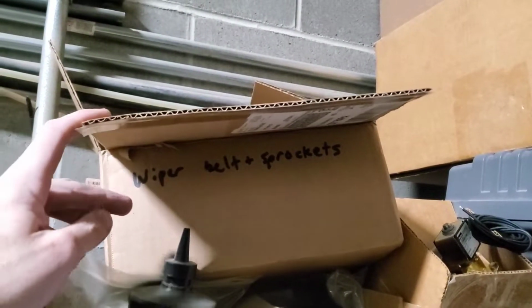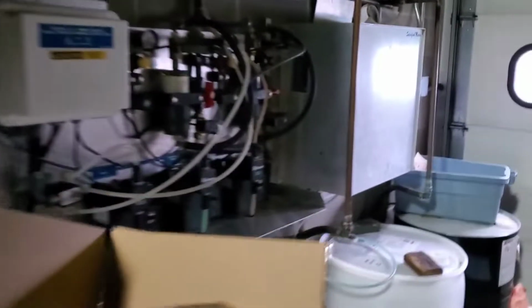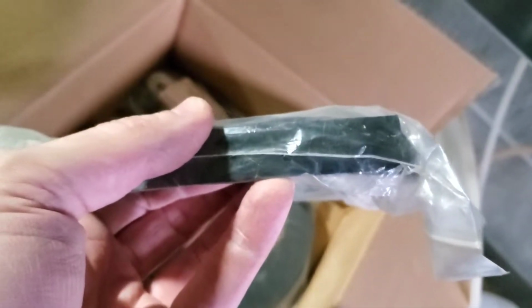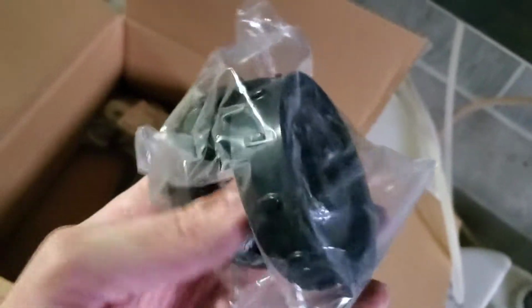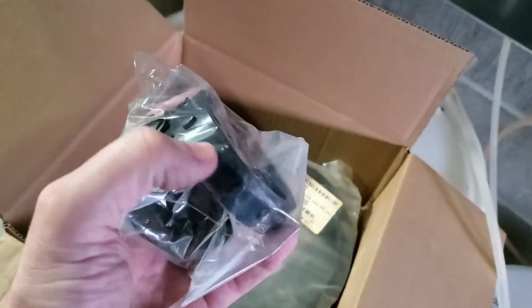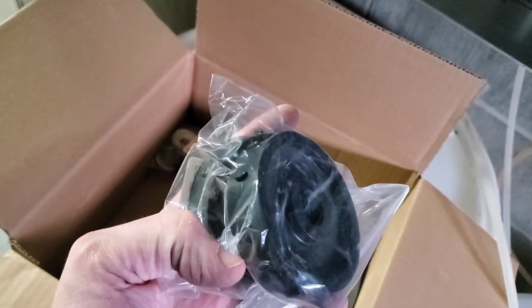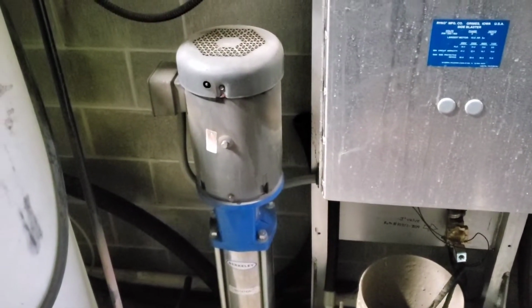And over the years, I've gone through a couple wiper belts that run that wiper that goes across the top I was showing you. I keep a belt, and I keep the plastic sprockets on each end of that, because what happens is that these things might stretch over time. These are just a band of plastic with holes in it, and they grab these sprockets right here. I wish they would make these sprockets out of like aluminum or some kind of metal, because when the belt slips and it wants to spin across these cogs, it's going to strip these little things off here too, the cogs, if you want to call them that. I don't know, but usually when the belt slips, it seems like it's because one of these sprockets is chewed up. And oh yeah, this does have 2 lube points, right there and right there. That one I don't do very often, maybe about once a year or so is plenty.